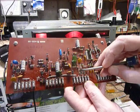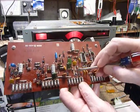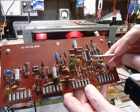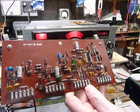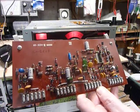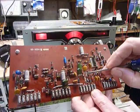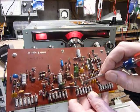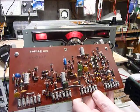There was also a 22K resistor going to ground. The signal comes in on pin 16, goes through the 22K, and joins with the 120K — that one goes to ground, and this one goes to the audio preamp chip for the microphone. So I thought, how can I raise that a little bit? I grabbed a couple of 47K resistors and replaced both the 22K and the 120K with 47K resistors.